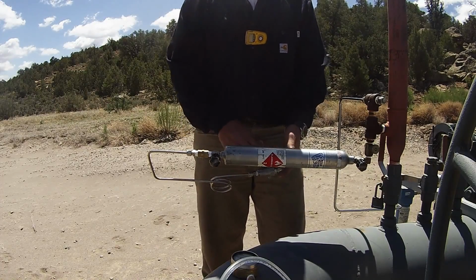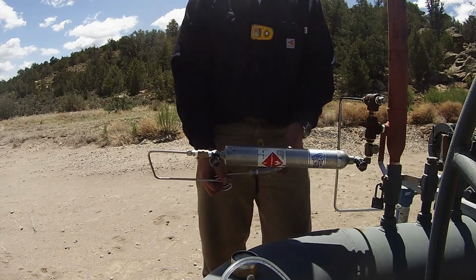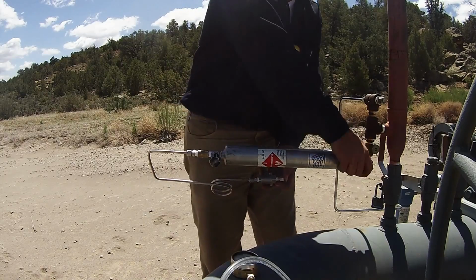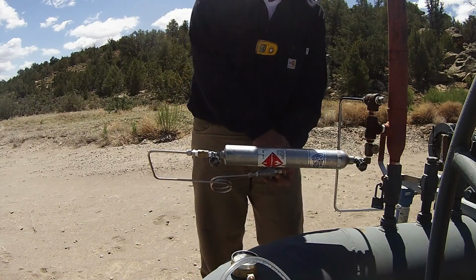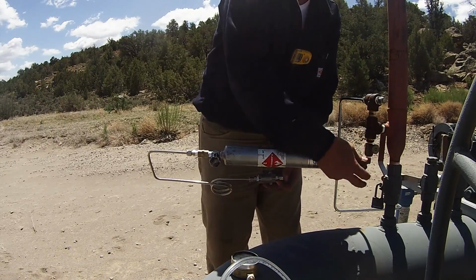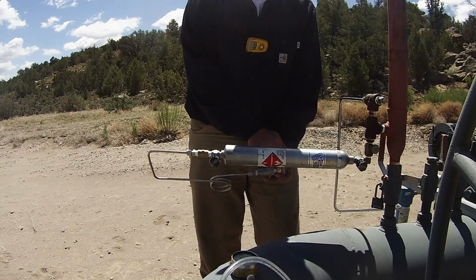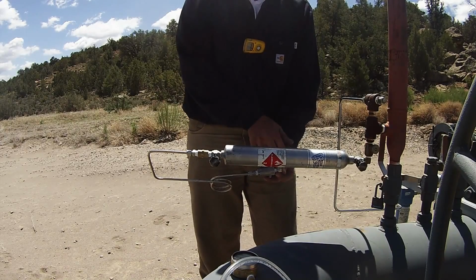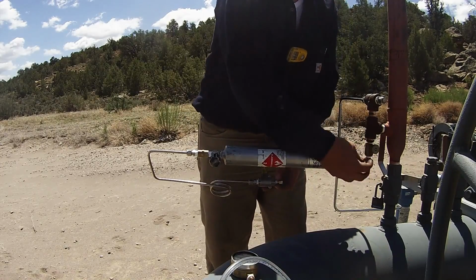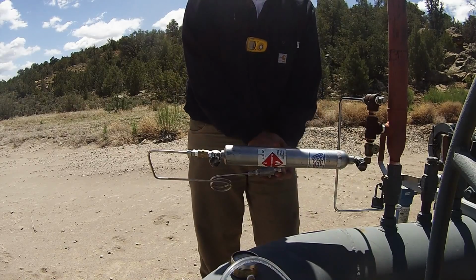If per se any air were to get back in the system, what this coil right here does is it traps the air right here, not letting it back into the bottle. So we're closed there. We're going to go ahead and purge this out again. Open it up. And this is our 4th purge right here. I use my fingers to kind of help me tell where my gas pressure is and not to bleed it completely dry, but pretty much get all of our gas out.